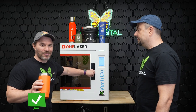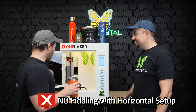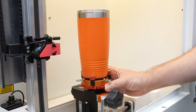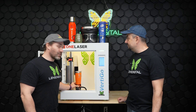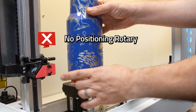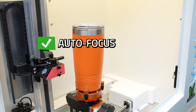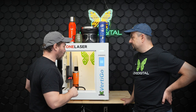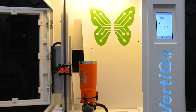So this is how easy it is to set up a tumbler. Look, I don't have to futz with horizontal anything. Put it in just like that. You tighten the grip. This is, by the way, powered by the Grip Two, but the rotary is built into the laser so you never have to align it, never have to make sure it's positioned right. I just tightened it just like that. This thing has an autofocus — we're going to hit autofocus, it'll go and find the perfect distance. You load your file and you're ready to go. You don't have to set steps; it comes pre-configured for you.